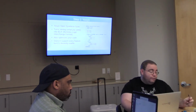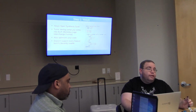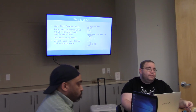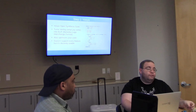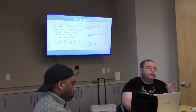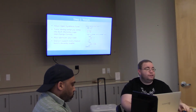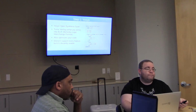But after you get that, BLIF or JSON, Yosys has turned your Verilog, which is a description of what your circuit's going to do, into a list of all of the logic cells that it wants from the FPGA. So it might say, I want to have a LUT with the following outputs. I want to have a flip-flop that is connected to this other flip-flop over here, and so on.